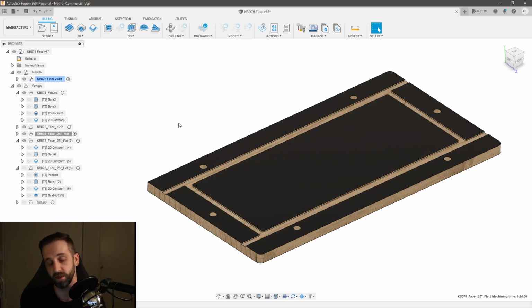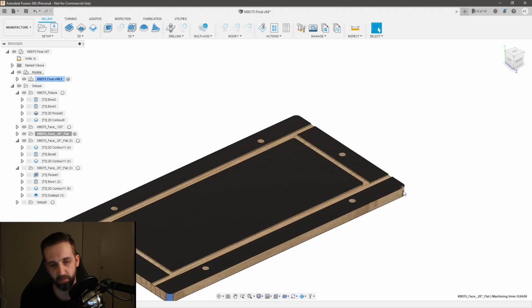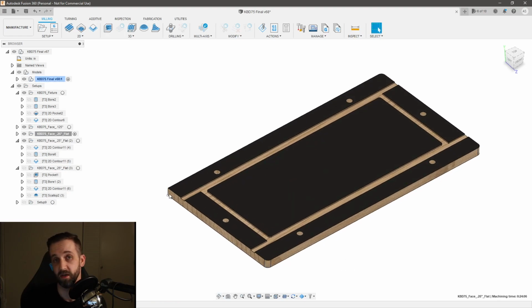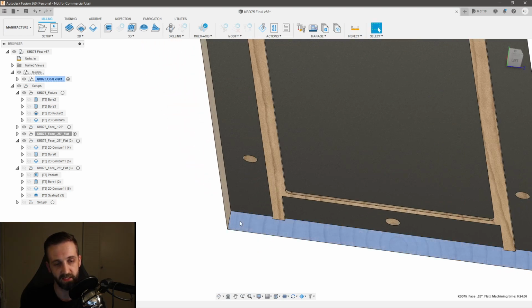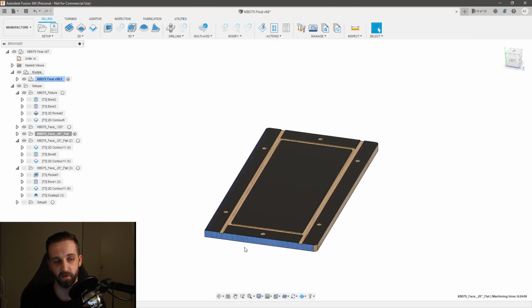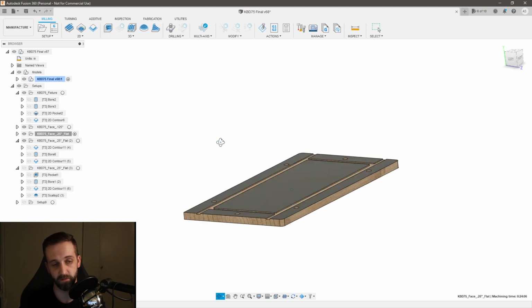And then the final one, which is arguably the most important of all, is on 3 of my corners, I placed a fillet. And the point of that was that one of my corners I did not. By applying the fillet on the other three, it told me this is the corner I always zero all of my programs off of. I never have to zero my program off of my stock or my model at any point. I have the same fixed or known point on my CNC where all of my programs start, no matter what orientation the part is in.